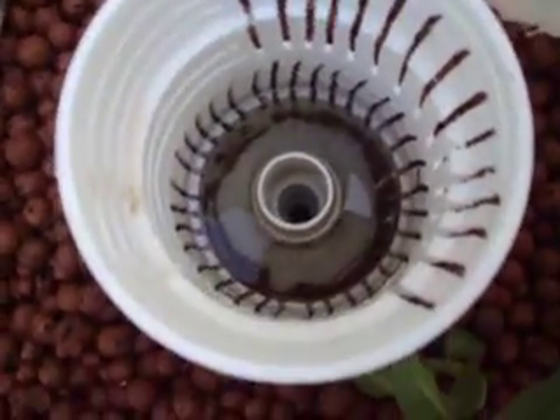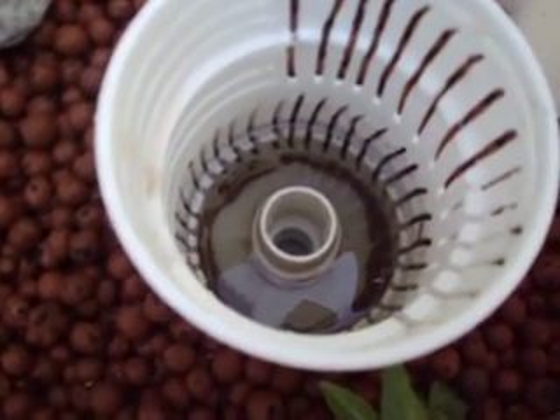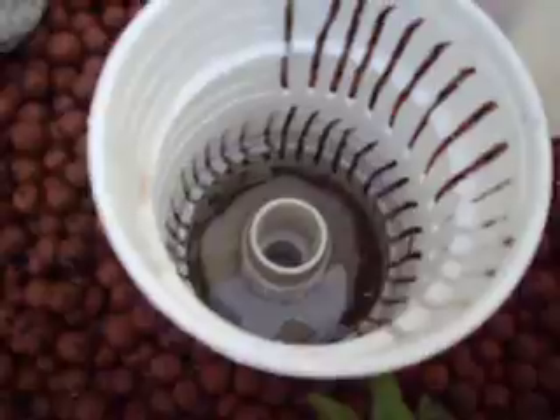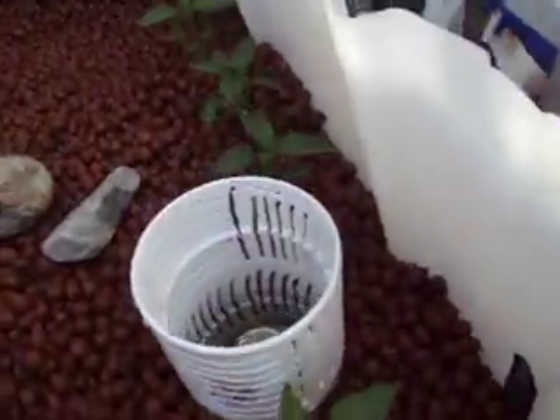One thing I found out was there's some kind of correlation between the diameter of the drain at the top versus the diameter of the line it's draining out of. The top has a one-inch drain, and then I reduced it down to a half inch — so it goes from one inch up here to a half inch down here. It works great, haven't had a problem.